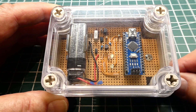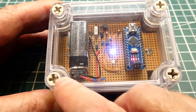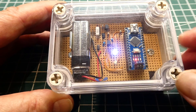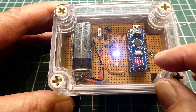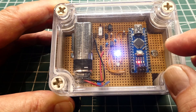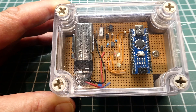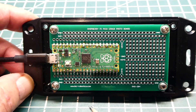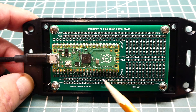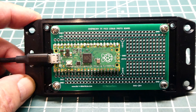Here's another idea if you're running your project on batteries: I have an impact switch, so a tap turns on the circuitry — no need to drill holes in the box for a switch. It will sense activity and stay powered as long as there's activity. When there's no activity for a certain period it times out, the LED starts blinking, and then it shuts off with no current draw from the battery. So that was my little tutorial on this Raspberry Pi protoboard. There's enough room to plug in a USB connector for Pico upgrades. I have a LED blinking running PicoMite on the Raspberry Pi Pico — it's a free download — and this makes for a very clean project.